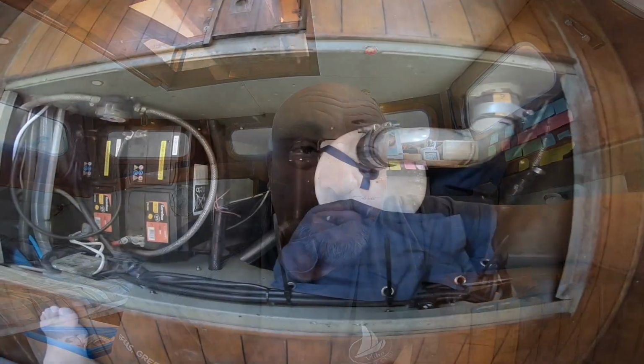So once I had to run one in a forward section where I had a weld crack, about 8 hours away from Safe Haven. So they have come in useful. I would definitely recommend anyone to have these sort of salvage pumps on. They're just submersion pumps. The plastic ones are better because they don't corrode. If you buy the stainless steel ones or the sort of cheaper versions, they're not that great. The plastic ones don't have metal pieces inside of them as such, so you don't get the corrosion.